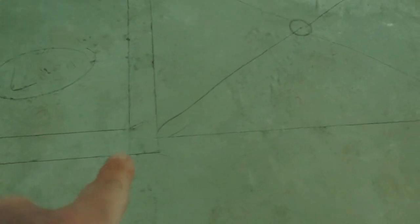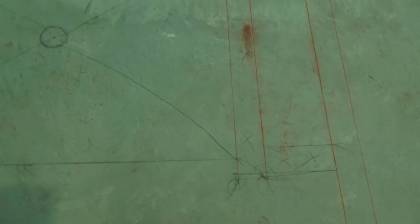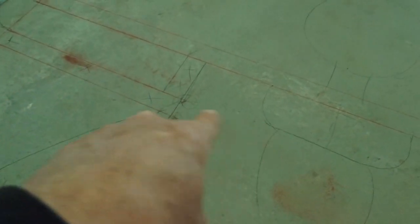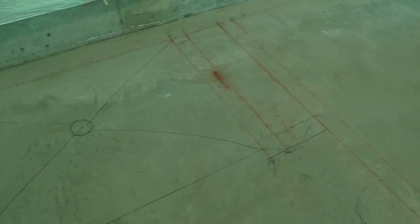Now let's step inside the bathroom. We've got our linen closet, 36 inches from the back wall out to the front, because my shower is 34 inches. You can see my shower line is set back in from the 36-inch line by two inches — that way they can get a piece of corner bead on when they do the drywall and the tub looks recessed back around the corner a little bit. I left another one foot of dead space so the shower would be pulled out of the corner one foot, because the toilet is right beside the shower. Instead of running the shower tight beside the toilet tank, I pulled the shower out one foot — we're going to have an elongated toilet that's 28 inches off the wall, and we didn't want to be tripping over the bowl getting in the shower.